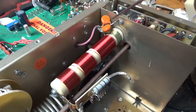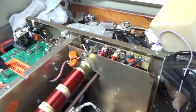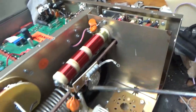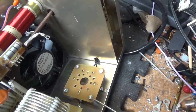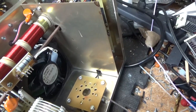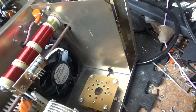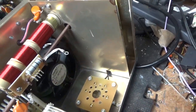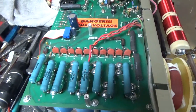Everything's soldered really well. Got rid of the wire for the 10 meter mod. No more Metal Oxide Varistors. Cleaned the input rotary switch with DeoxIT Gold, cleaned the output rotary band switch with DeoxIT Gold. Grounded the grids right to the metal — the nuts below were loose. It goes through the foil between the grid and ground, but I like a nice short path to the chassis. Holes are already there from the AL80A, so why not.